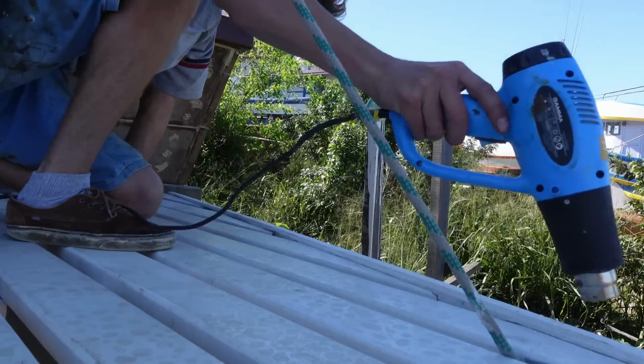And now I've got a heat gun that I'm going in all the joints with as well. And then when that's done, we're gonna start applying the same caulking compound that's on the hull in all these little water traps, so that when we put on the next layers of primer epoxy paint, we can really make sure no water gets trapped. Because based on what we saw on our previous platform, lots and lots of water gets trapped in here.